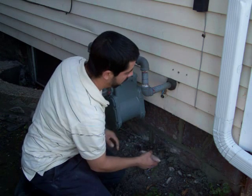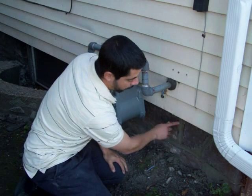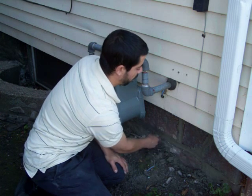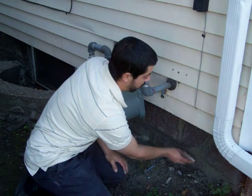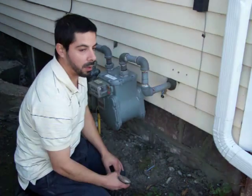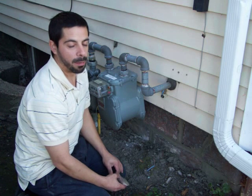During this process too, it's best if you start with the up and down joints, the headers first. That way your bed joints look more seamless going across. And that's it. Just let it dry, and then we'll come back and brush it.